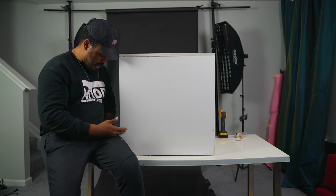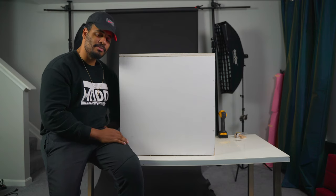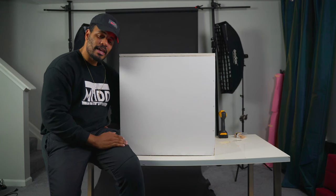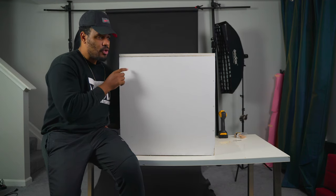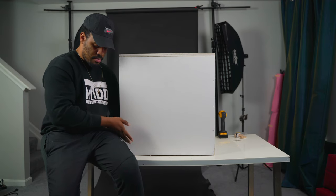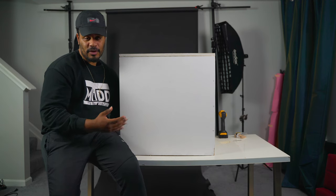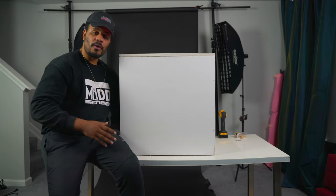The last thing that I have here is that you've seen those angle pieces that I used inside of this box. I used two. Those pieces are so cheap, like 50 cents a piece, that instead of putting one here and one here on each corner, I would actually go back and probably add a third one. So one in the middle and then one on the end, because it doesn't cost me anything, 50 cents for each one. So that will add some extra support as well. So that is kind of everything that I have here.